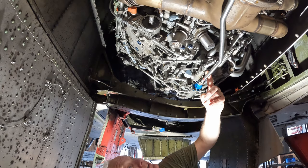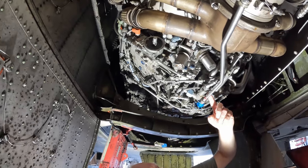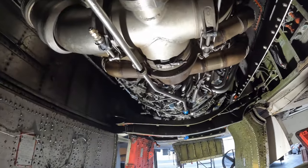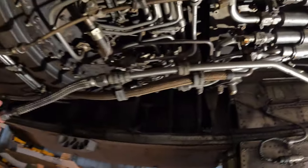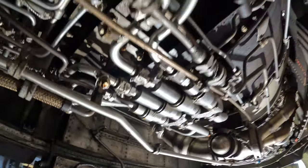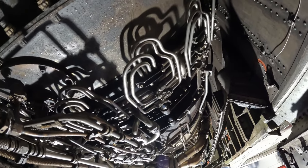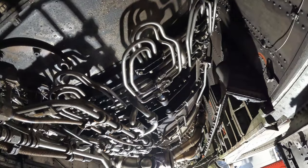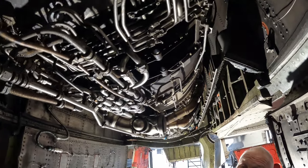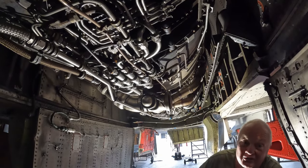This is your afterburner fuel pump. This main line right here is fuel. These are your afterburner spray bars — you can see there are four lines going in because this is a four-stage afterburner. You can go from stage one, two, three, four, and you can tell the difference every time it goes into another section of the burner. There aren't really physical detents on the throttle, but the airplane will tell you it's in another stage of burner.